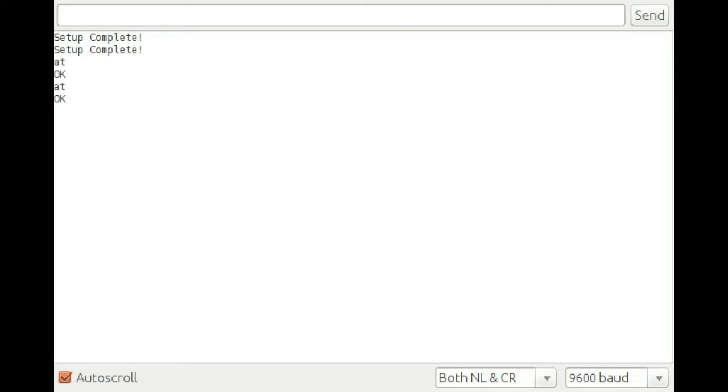There should be a bunch of different AT commands that you send to it to do a bunch of different things. I checked the data sheet and there are tons and tons of commands. This chip can do all sorts of stuff, including voice — so it is actually the cell phone chip. If you were to send a stream of audio into it, it could actually work as a cell phone. But what we're going to test right now is just the SMS and data communications of the chip, because the Hologram network that I registered the SIM card on only does text — it doesn't have any voice capabilities. But probably if you put in a regular SIM card from a regular provider, you would be able to get a cell phone out of that thing.